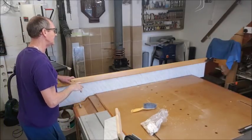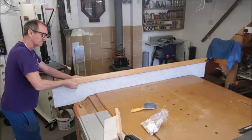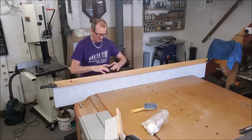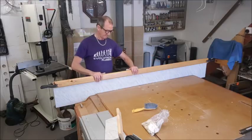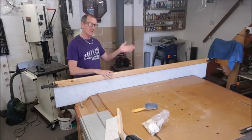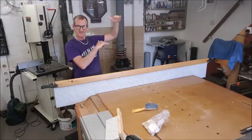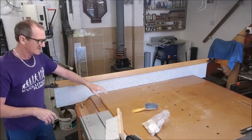Now what I want to do here is, this is the bottom part of the shelf, and this is going to be the front runner that will sit on it, giving it that match in appearance of the rest, but also it gives it that strength, almost like putting a beam across the front of it. So suddenly that shelf becomes that thick. The back wall is, as you've seen, just short of 300 mil deep, so again, that's almost as strong as an I-beam. Now I'm setting the biscuits like I've done.